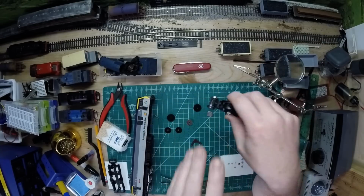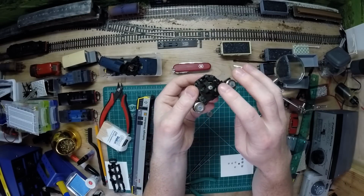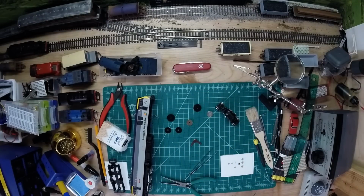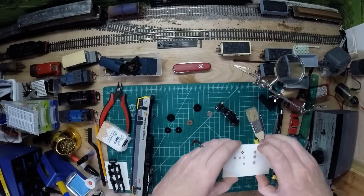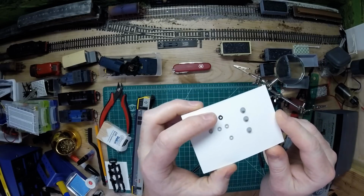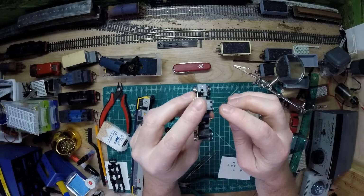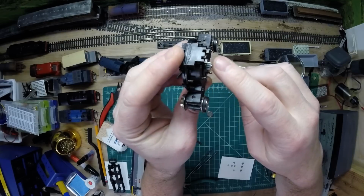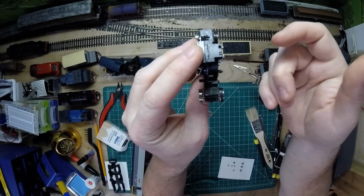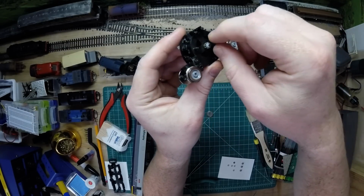So why was it doing that? Well, it turns out that this slightly newer Ringfield motor has a plastic piece that sits on top that's supposed to stop it from moving back and forth. The plastic piece is right here in black. It turns out that over time, this plastic piece got slightly bigger. Not much, probably about a fraction of a millimeter, but big enough that it was basically starting to slide off of the, I'm not sure what you call it, rail, I don't know. It was basically sliding off this thing. So basically the plastic piece would pop off and then this would also move up.